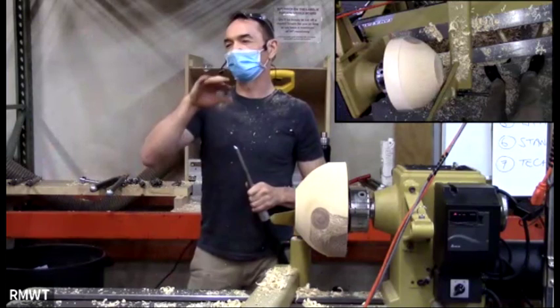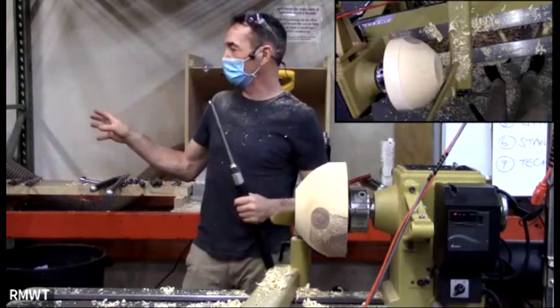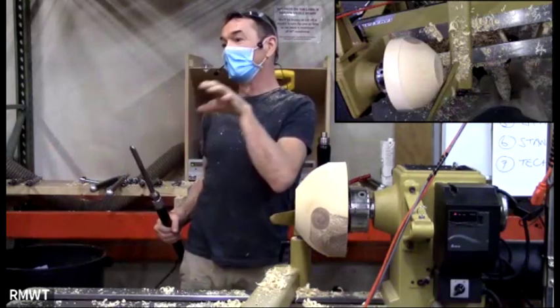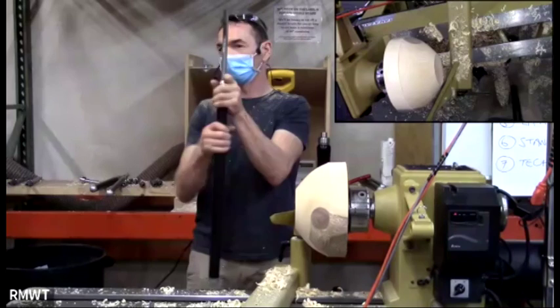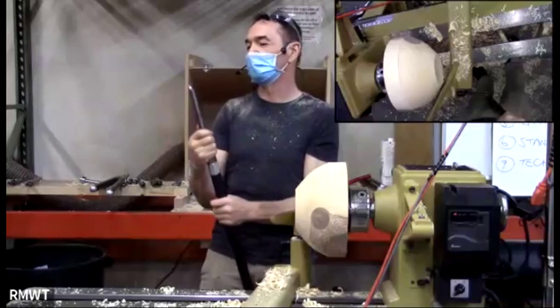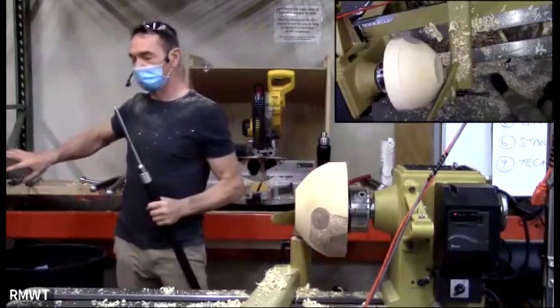I think about 350 is ideal for touching up a gouge. The problem with 600 is it's really easy to sharpen your tool, go back and think it doesn't feel any difference because you missed a tiny spot, because it takes off so little. You can do that with the 350 as well, but we don't want to be using 80 or 180 for our gouges because this is a consumable, and you'll be consuming it really quick. I was teaching a class the other day where they had the 80 on the wrong side for us, and we were wearing down our gouges really fast. So we swapped them around because I said we're going to burn through a gouge so quick. If you're using a 350, that's really good, and then keep a coarser one to the right.